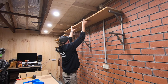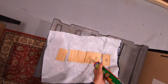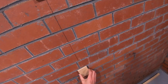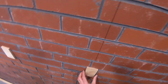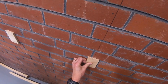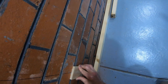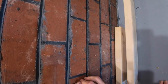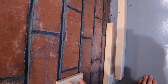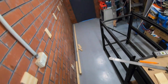After removing the old shelving and brackets, I'm using liquid nails to attach the plywood spacers to the bricks. I've marked out on the wall where they all need to go to line up with the battens, which are spaced evenly in the center and either side of the plywood sheets. They don't have to be super strong - it's just tacking them in place because ultimately they're going to have an anchor bolt going straight through them into the brick, and that's going to do all the work. This is just to hold them in place temporarily.